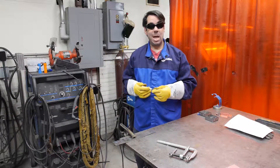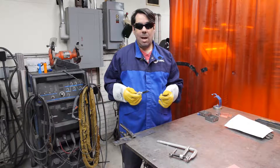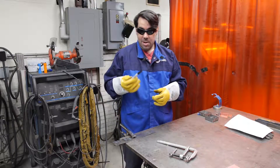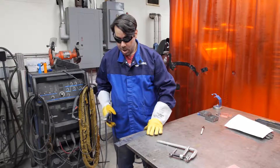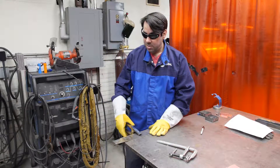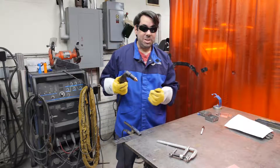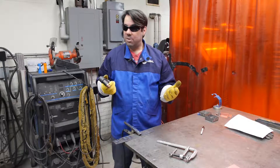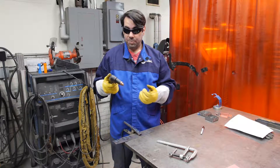Finally, we're ready to proceed with the actual plasma cutting demo for the students. We simply grab a piece of sheet metal — we have a trash can full of scraps in the welding shop and a bin by the sheet metal area with smaller drops we can use for the demo. It doesn't matter whether it's aluminum or steel. Next, take a sharpie and draw a cut line on the part. Then clamp the sheet metal to the welding table using the ground lead, making sure your cut line is free of the welding table. Make sure all students have their welding helmets on. If you prefer to give them the darkly tinted plasma cutting glasses, that's fine as well, but be mindful that the glasses are about $50 a pair, so tell the students to be careful not to drop them.